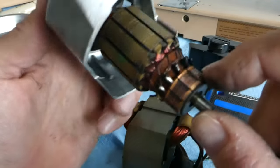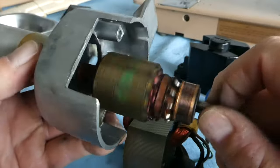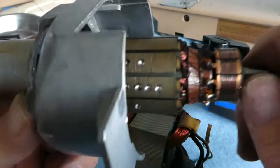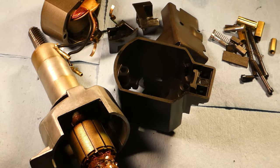So there we have the spindle, or whatever you call it. There's the commutator that we're going to take 1,000 grit sandpaper to, then get to work on cleaning that. And when we're all done, give it a good spray with an electronic contact cleaner, then let the contact cleaner evaporate off. Here is the result — the motor is apart. That concludes our removal of the motor and taking it apart video here today. The next video will highlight cleaning the commutator and the other associated wiring on that spindle. Thank you for viewing and subscribing and watching. Hit the notification bell and you'll get notified every time a video is published. Adios, amigos.